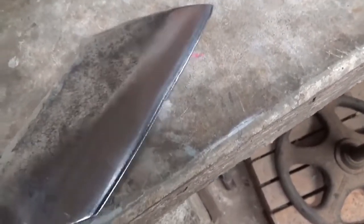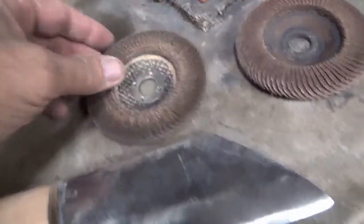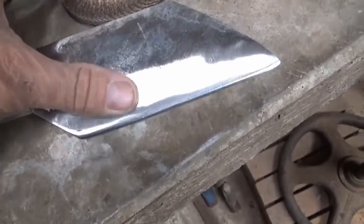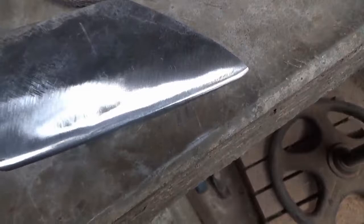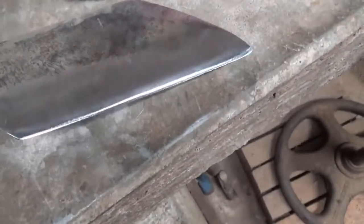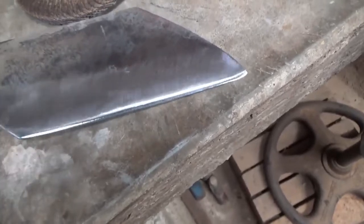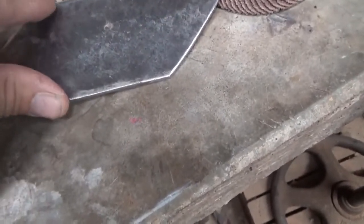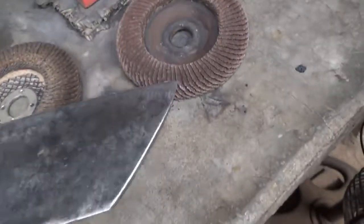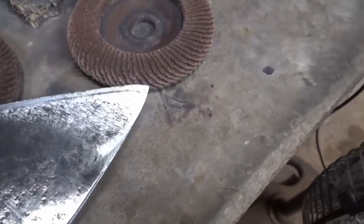Slightly rounded edge, but not bad. I ground and ground and ground until — it's very interesting using the sanding wheel as it doesn't get hot. I put it under the water once and touched it first — it wasn't even hot. So I'm not worrying about the temper of the knife, even though this has probably barely been tempered; it's been quenched is all when it was made. I ground it down until I came up with a burr on the backside, and went the whole length until I got a nice even burr on it. It's not actually a burr, it just looks like it. I can see some little nicks in the blade here — teeny little nicks. That's because it's so thin I think.